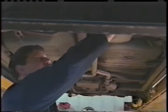We'll go ahead and undo these self-tapping screws that hold the muffler up. Therefore, we're able to take this system off in one piece. We've only got the bolts to cut off and one saw cut here. At the back of the car, we have a welded hanger assembly, and then spot welded on either side of the tailpipes, you need to clip those.